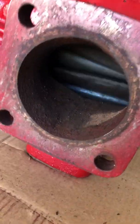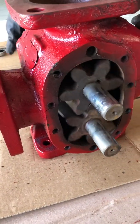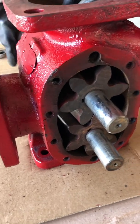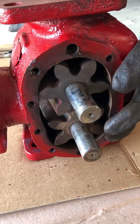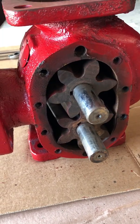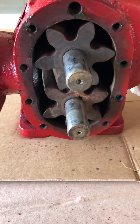When the shaft turns, the pump is actually moving — this is how the product moves: it comes in and is pushed out. This pump can go either way, so we rotate the pump body to have the inlet and outlet in the right direction. You can reverse the body if needed, but you don't have to worry about that. Those are the things you should watch for. I hope that helped you have a better understanding of a Roper pump. If you have any questions, just give me a call. The reason we like Ropers so much is they handle such a broad spectrum of products, from heavy resins to acetones. Thanks a lot for your time, and as always, drive safe.